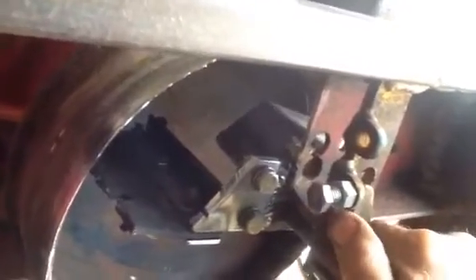Now this plate is spring-loaded. You can see as I move it — that's so when the piece of two by four is in there and gets cut off, being that it's on the inside of the circle it wants to jump out and jam in there. So it's spring-loaded so that the bottom guide plate will move out of the way.